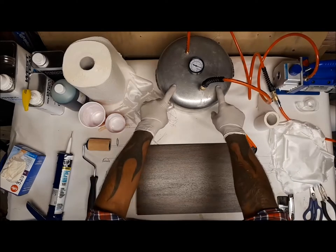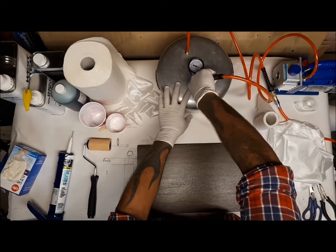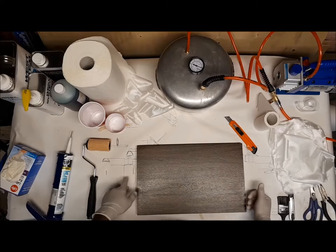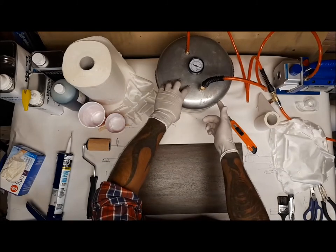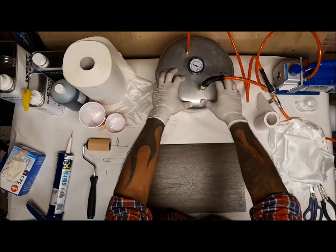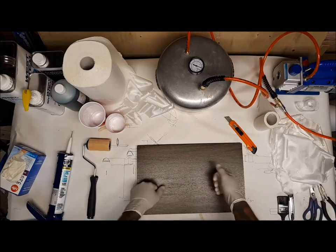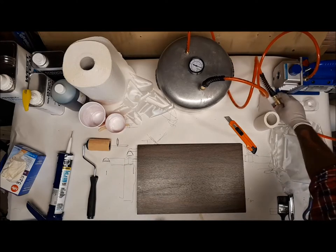My vacuum pump is an RS1 oil pump — a very cool thing to have. The vacuum chamber is a cooking pot, roughly nearly four millimeters thick aluminum, gotten from a secondhand shop. I put some caulking around it and sellotape, and once I tested it the pressure held at minus one bar nearly through the whole night, dropping only slowly — good enough for me. I'm using it as a vacuum chamber, or degassing chamber. I want to get the vacuum ready first before committing, because once it starts sucking there's probably no return — if something goes wrong you have to peel it off.